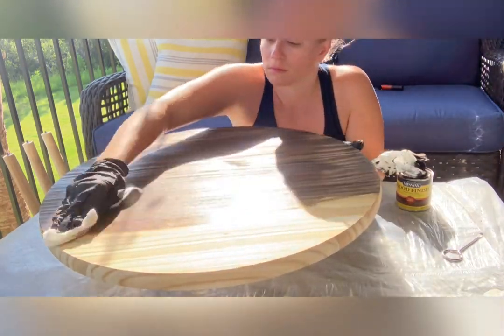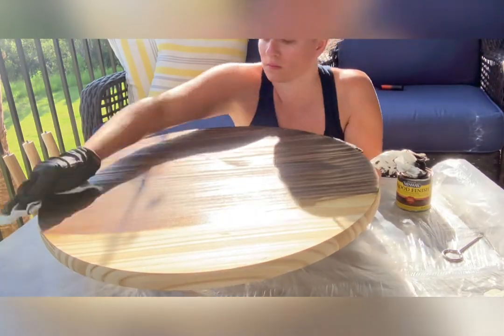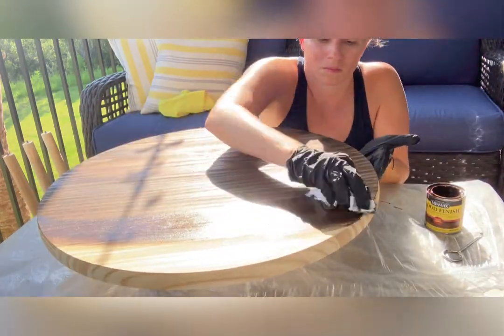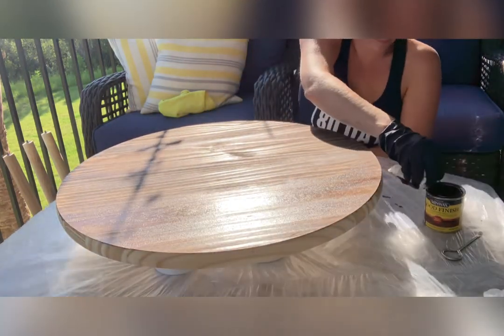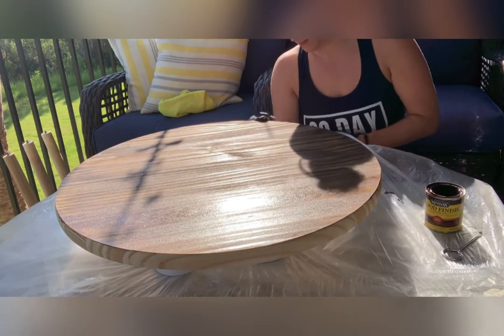Before I got to the end, I took a clean cloth and dried off the excess stain. I did this because one, I had my arm over there and was going to get some stain on it, and two, I just didn't need all of that stain on there. I think it just leaves a better finish if you can wipe back some of the excess.